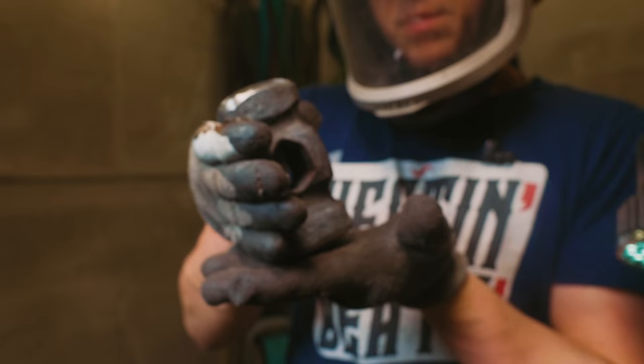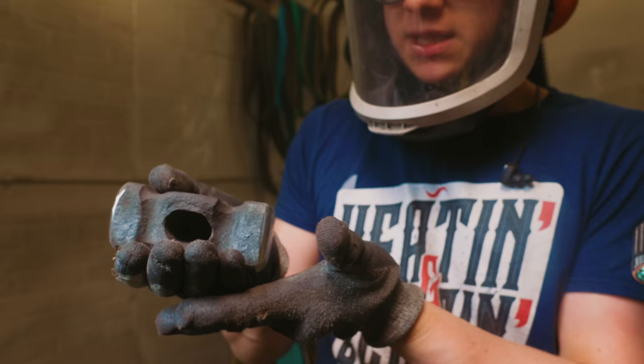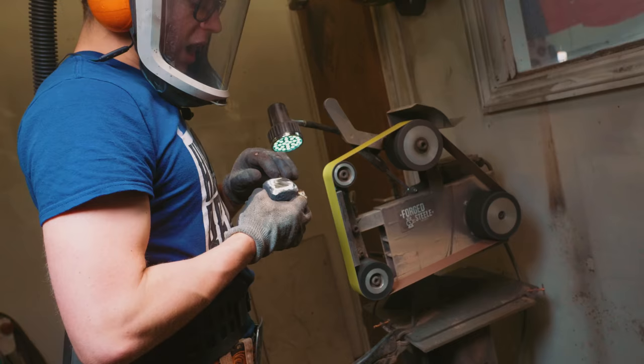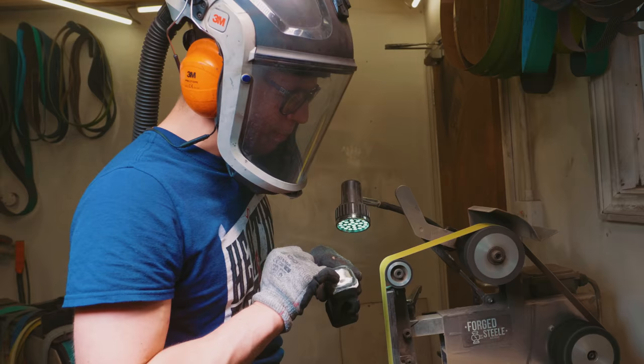The face all the way up and then I'll finish sideways with the hammer and finish rolling it off. That gets me one consistent path from side to side without a facet like we have on the other direction, because when we use the hammer this is the side where we're angling more and this is where I want to avoid having any sort of hammer marks the most. Up to now we've done almost all of the round face on the flat platen.